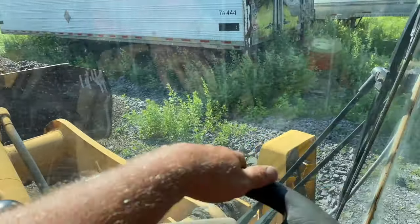Okay guys, we are over here stripping the forms off today, and we are gonna put this foam board around the outside of it because this is a heated slab, as you've seen in the video. So we ripped these up on the table saw. We're just gonna put it up against there and put some dirt against it, put some gravel that we got there. Got a couple more loads today. There's going to be a flashing detail that sits under this wall and goes down and over the foam. That's how we're going to handle that, because the wall is going to sit right on the concrete slab. They're going to use a treated plate and just build their walls right on it.